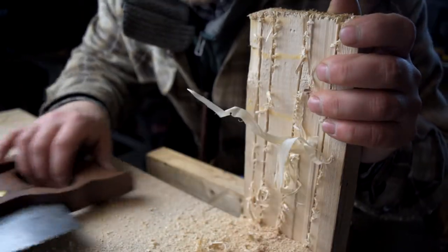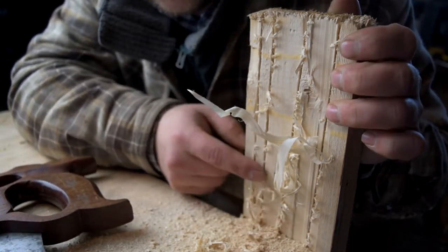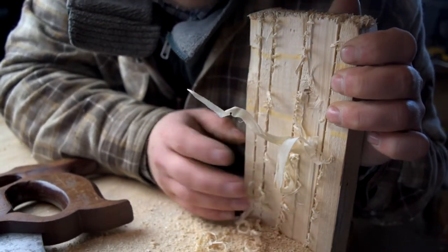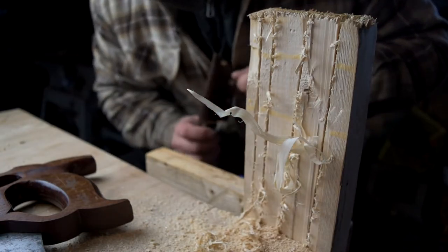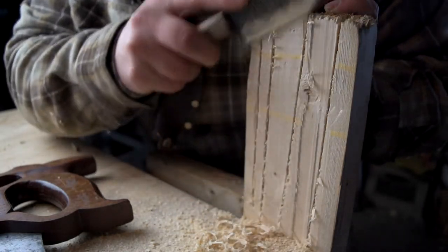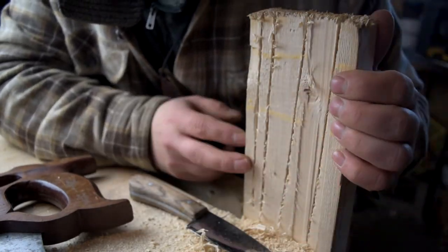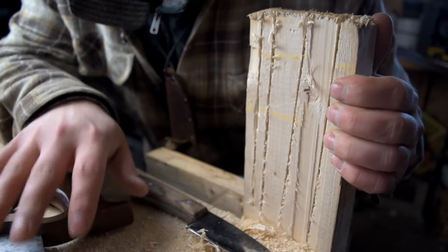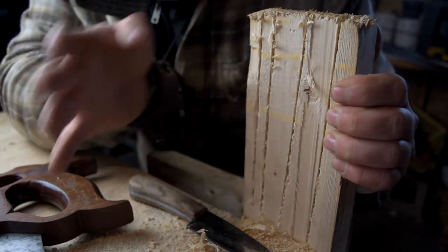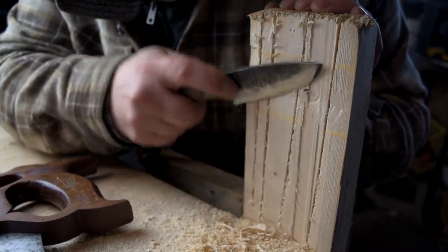Remember, this is a really coarse cutting saw — it's a five and a half point — so some of the results show that. I'm really working the saw hard as well. This is softwood, so you get a lot of tear-out. This is not made for cutting finished pine for a jewelry box — it's made for ripping down heavy material. But you can see the potential and how easy it makes that.